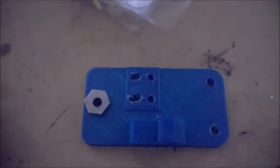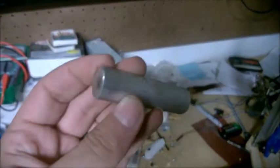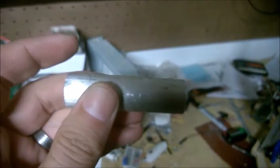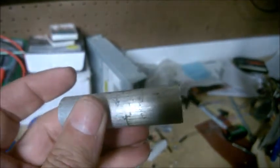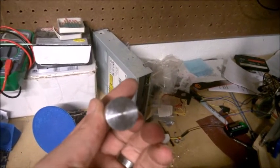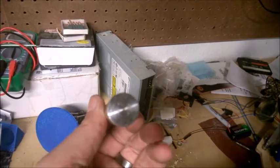It's really good to have. So we're going to walk through how to make these. Pardon the horrible camera skills — I have none. I'm not a photographer, I'm not a movie maker, I'm just a maker. So this is a small piece of aluminum I've already prepared. We're going to go ahead and chuck this up in the lathe and put a four millimeter hole through this, right through the exact center. I'll show you why in a minute.